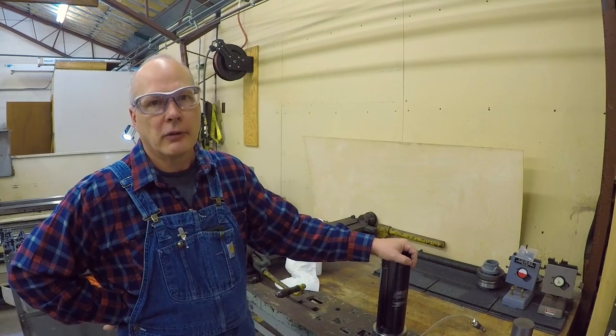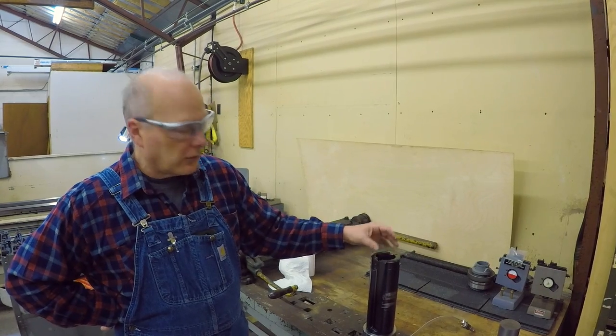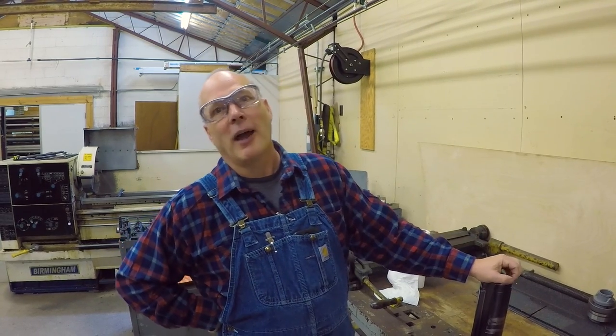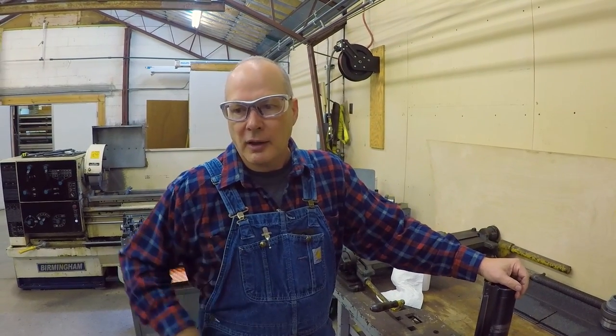My machine is 10 horsepower, and when I drill some of the steels I can't achieve optimum surface speed because I don't have enough horsepower in the higher range — the power band isn't up there — so it wants to stall the machine. I have to stay in low gear, taking it up to maximum RPM in that low gear. It's a real fine balancing act on my particular machine because I don't have quite the horsepower necessary to drive one of these right. What we want to do with carbide is get the chips to break up.